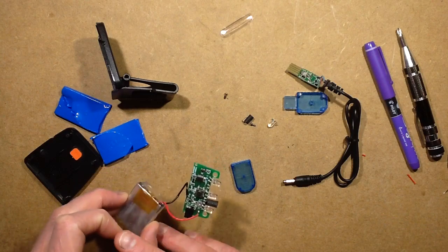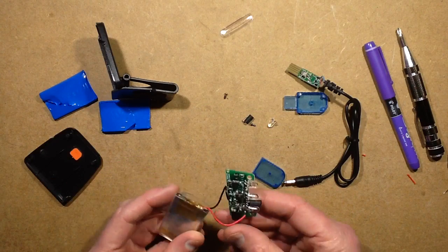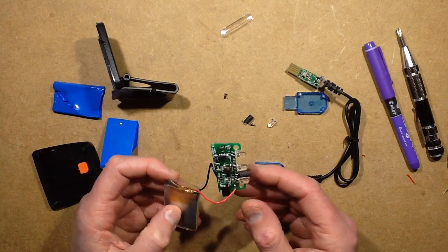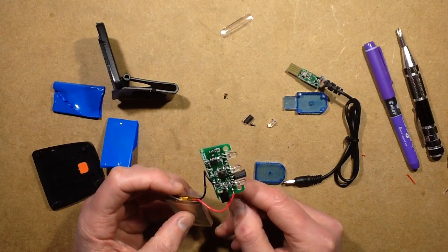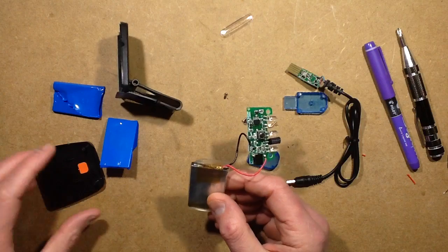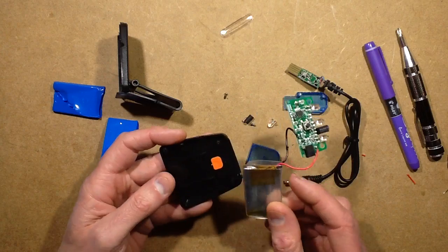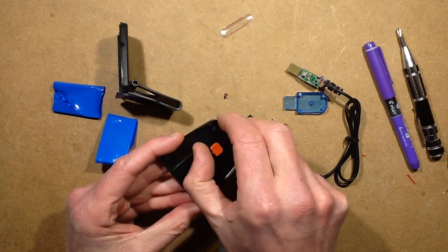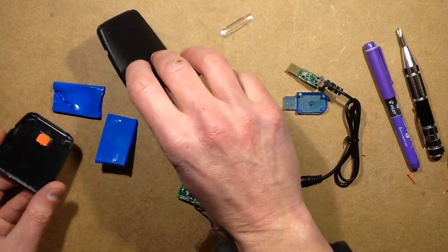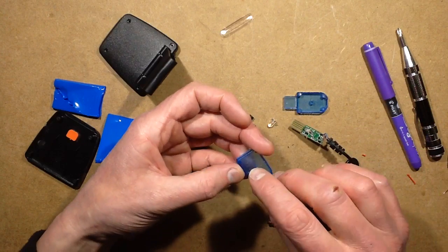Now I've had a thorough play. I haven't managed to fully charge the battery to its full capacity yet, but I have the covers off. A couple of things to note: the battery does not have protective circuitry in it — I peeled the covers off to check. I also wanted to check why the negative terminal is red and the positive terminal is black. That cable's been nipped quite tightly against the plastic casing. I've put heat shrink back over the cell but it's a really tight fit. This lithium cell is held in place quite snugly by a proper retaining mechanism and spacer — that's quite a good aspect of it.